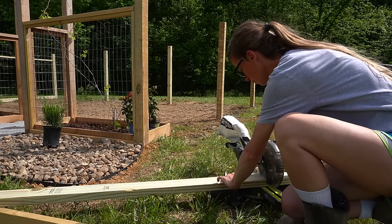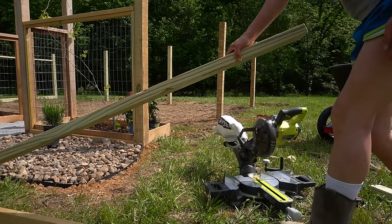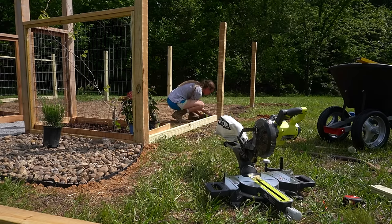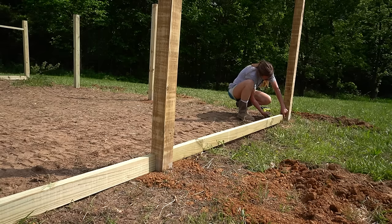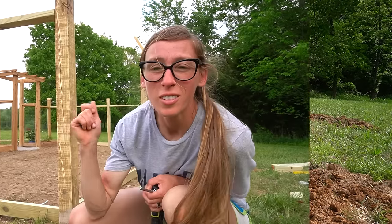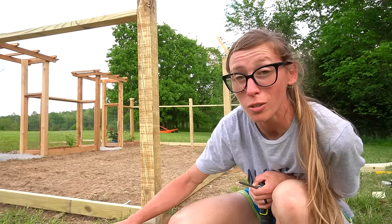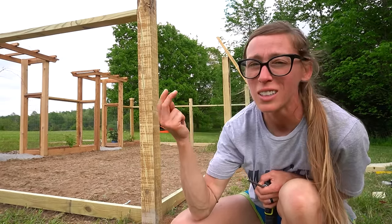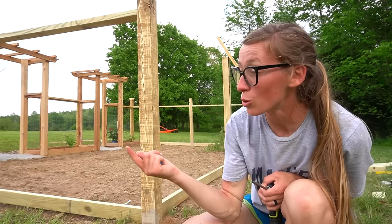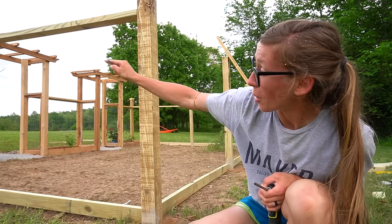Once the six posts around the sides were set, I repeated the same process as on the front to add the framing. I cut to fit the 2x4s at the bottom and then another at the top, securing them to the 4x4 posts while trying to keep them straight but not necessarily level. Basically I screwed in all of the 2x4s around the bottom — I cut to fit them between the posts and drove them in at an angle with 2.5-inch decking screws, toenailing the rest of the way. And now I'm using pocket hole screws for the top pieces.